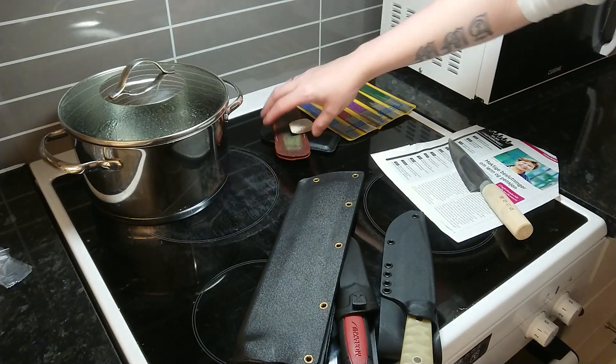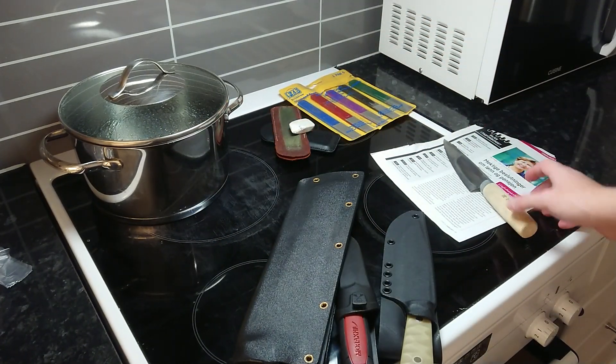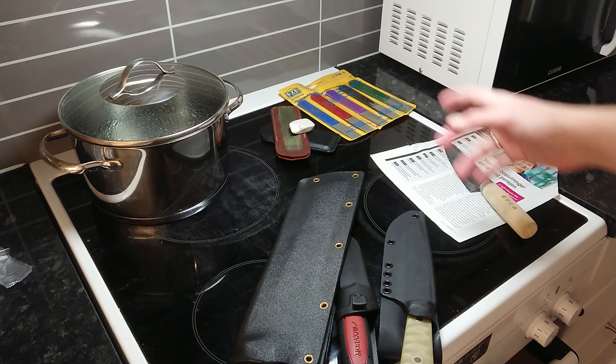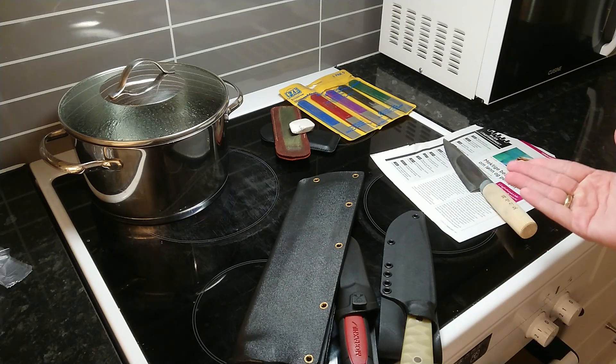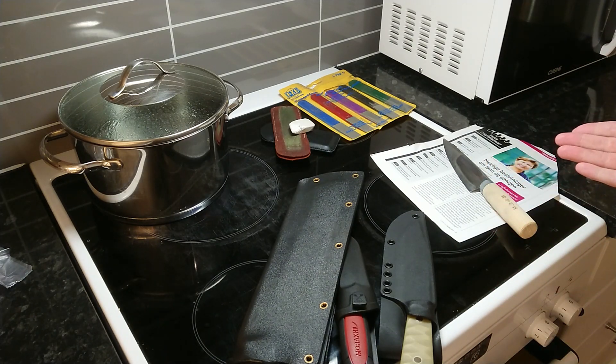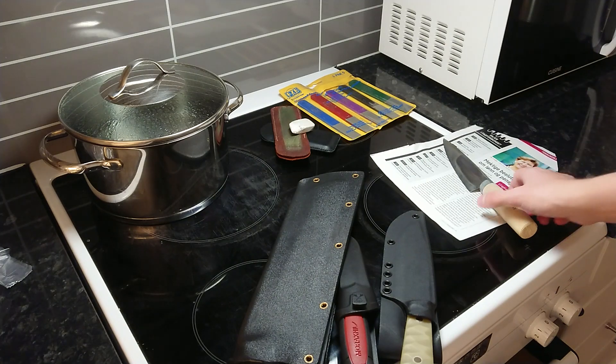What I use to sharpen with, I won't bother showing you because you sharpen like any normal knife — it's just like sharpening on a whetstone. You de-stress the edge by dragging it into the stone, you create a burr, you weaken the burr, you shear the burr off, and you polish the knife.